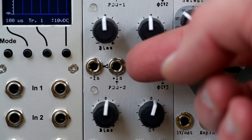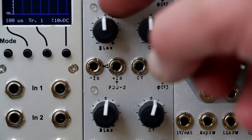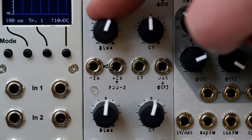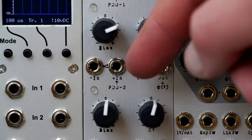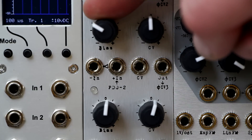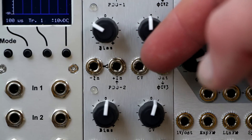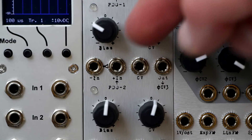Plus N is the primary input. Its signal is routed to the minus N through an inverter. So when you have a positive control voltage, you get the signal on the plus N jack. When you have a negative control voltage, you get the signal on the minus N jack. If nothing's plugged into minus N, you get the inverted signal of plus N — thus bipolar attenuator.